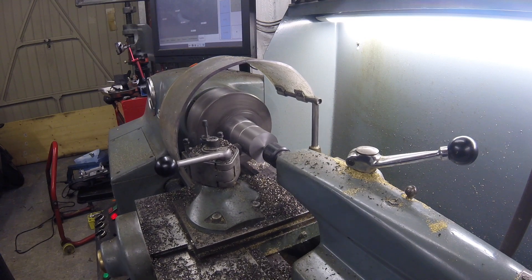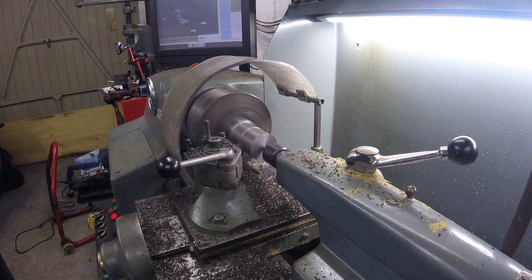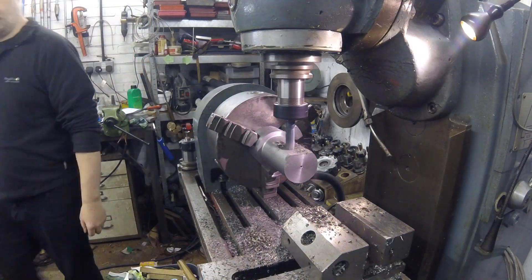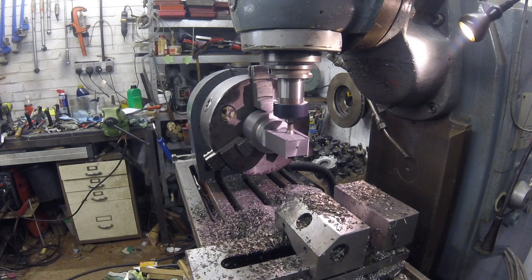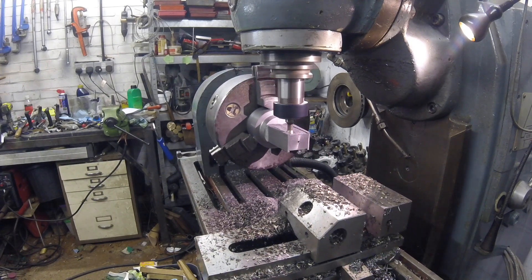To make the moulds, I started with a large piece of CONCAST durobar iron, which was a bit too big. I could have milled this away, but turning is quicker — shall we go fast forward? Then squared off on the milling machine to the rough shape. Then onto the mill to machine the dovetails and the outside shape. I made this as two parts, which were then split with the bandsaw to be assembled.